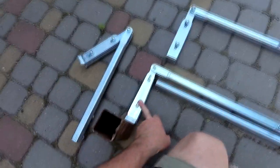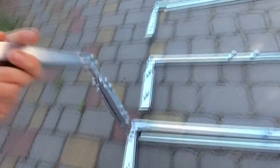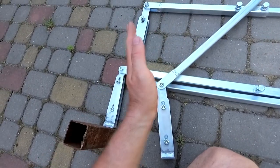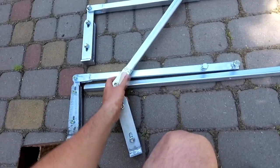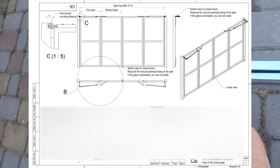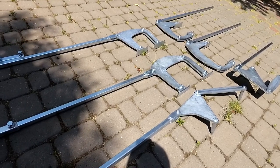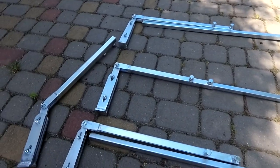The mechanism has a telescopic rod, one end of which is attached to the adjustable rod of the bracket located on the gate post. The bracket should be located on the edge of the pole. The bracket on the pole has an adjustment slot for moving the rod. By extending or retracting the stem, you can change the opening angle of the leaf — less or more than 90 degrees. This is useful for final adjustment and also corrects mistakes made during installation of the posts, if they are not in the same plane, or the hinges are not installed according to the standard scheme. If the hinges are located between the rack and sash, you will have to reduce the length of the adjustable bracket rod on the rack.